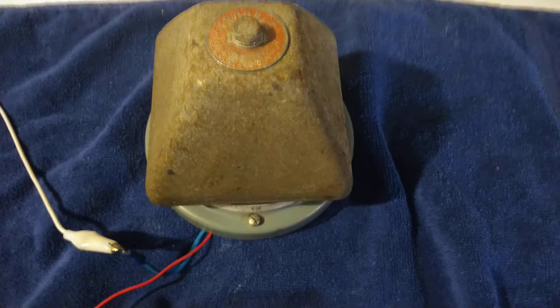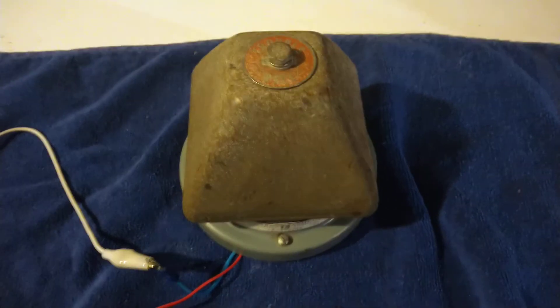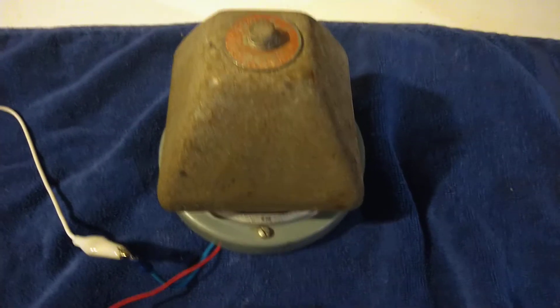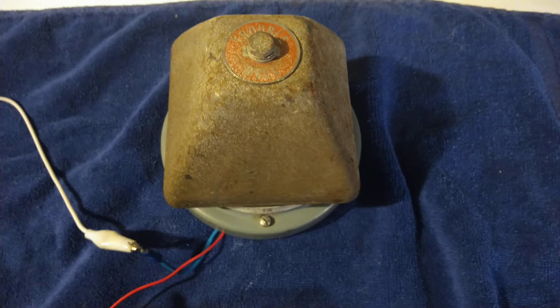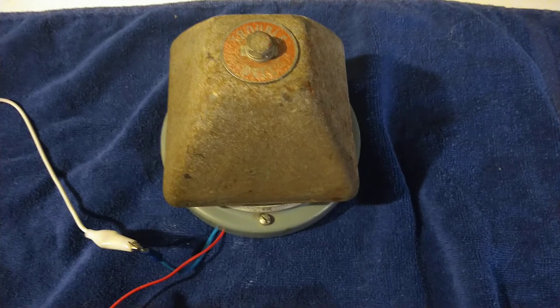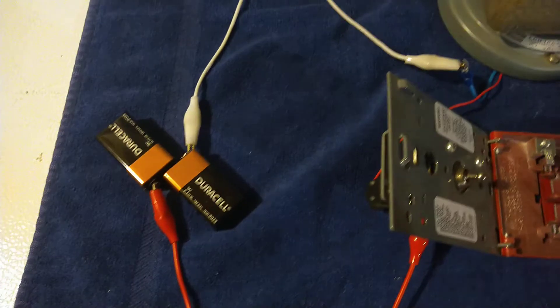This is the DC variant of the Edwards 340T treble bells. The 340Ts operate off of AC, usually 120 volts. This is a DC bell, and unlike most DC devices, this does not operate off of 24 volts, not even off of 12. This is a 20 volt bell.